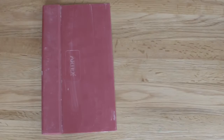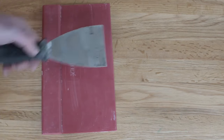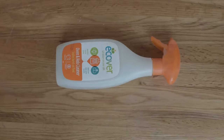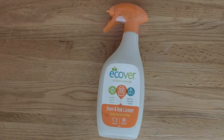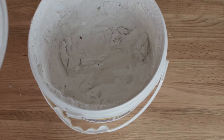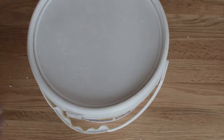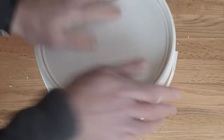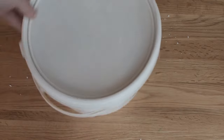Scrapers in different widths and sizes — you need them to be able to fill holes of different sizes. And then this stuff needs just a little water to help with it. It is great for filling holes. It's called skim fill, it's ready mixed and cheap — about ten quid for this big pot — and it lasts for ages for any kind of cracks and fills that you need to do.